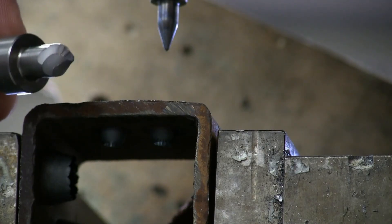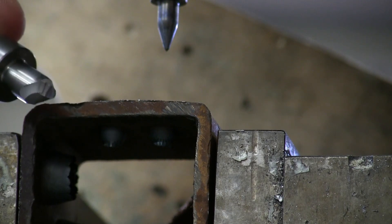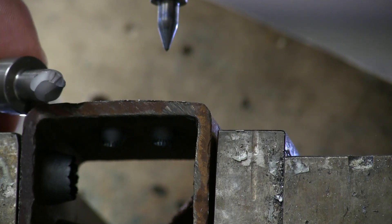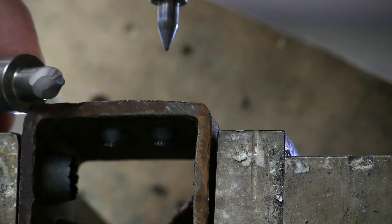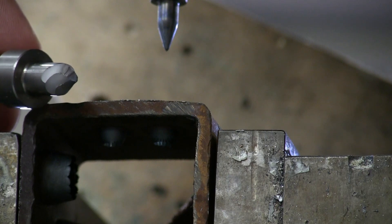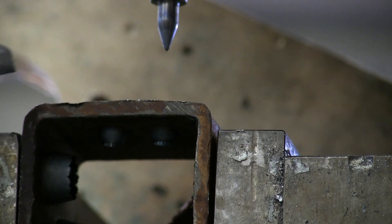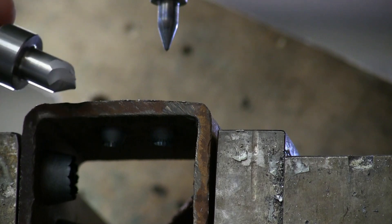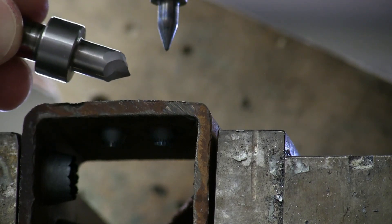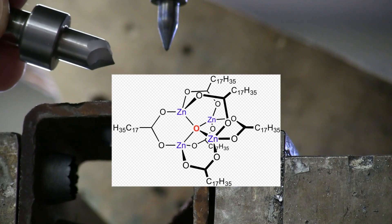After the catastrophic brittle failure of the 3/8 flow drill, is there a lubricant you can use to prevent it from welding itself into the steel? Yes, there is. They sell it and it's mainly, according to the MSDS — or nowadays the MDS, material data sheet, not the material safety data sheet; I mean committees need something to do, am I right? — it's mainly consisting of zinc stearate, so a metal atom or metal core with fatty acids all over the place. It's a big organic chemistry kind of salt molecule — basically a big clusterfuck of fatty acids with a core of zinc oxide.